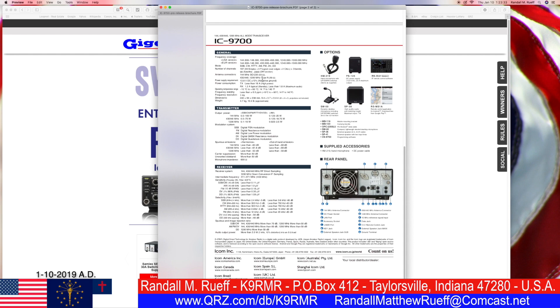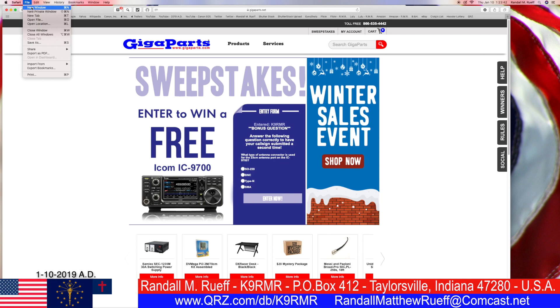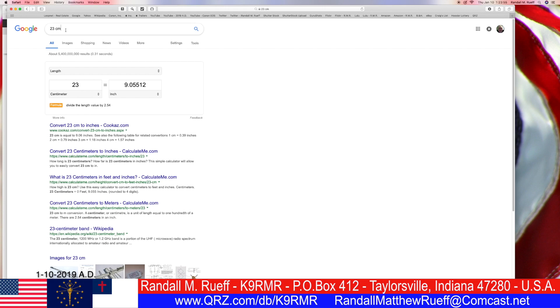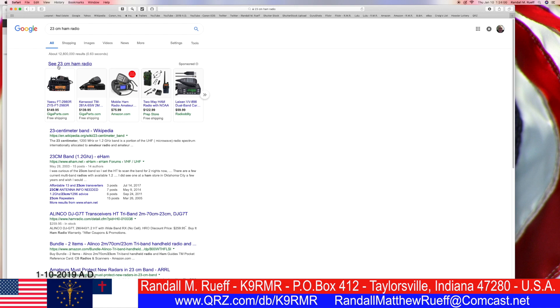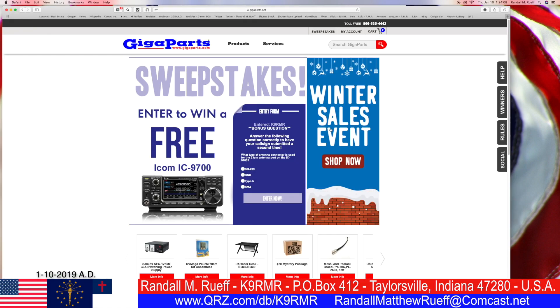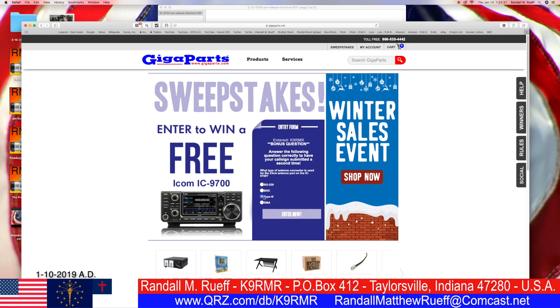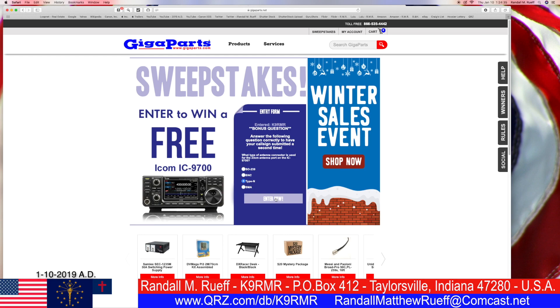23 centimeters. That may be what I want. I'm not sure. 23 centimeters — that might be the answer right there. But I don't think it's 50 ohms SMA — it might be Type N. 23 centimeters is 1200 megahertz or 1.2 gigahertz. So I think this connector is the one right there. Lost my place — 50, 443, 1200 megahertz. Type N. According to that, it's Type N.